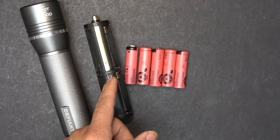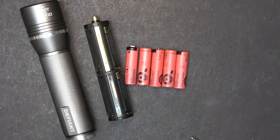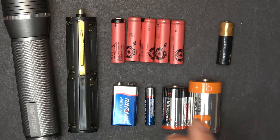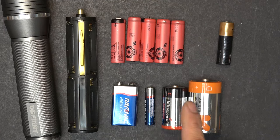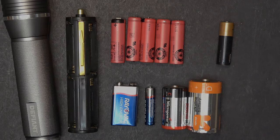All I have to do to undo the modification is pull out the nickel strip and I can put alkaline batteries back in if I need to. This process is reversible, whereas the spot-welded modification is not — you cannot put alkaline batteries in there anymore because they will short out. So there you have it — how to modify your electrical devices to run on lithium-ion batteries instead of AA alkalines. The 14500 can also replace other alkaline batteries too: 9-volt, triple-A, C, D — it will make all these alkaline batteries obsolete. Stay tuned and I'll see you next time.